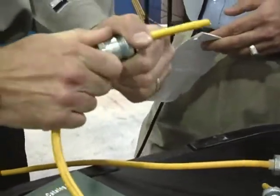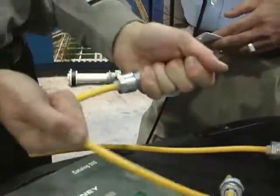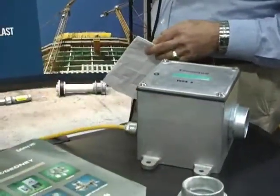Same thing is going to happen here. And what that does is allow this connector to accommodate a broader range of cord, and at the same time you get tremendous pull-out strength. Here I've got this cord installed into this cast electrical enclosure, and you can see that I'm literally getting tremendous pull-out strength with that cable support.